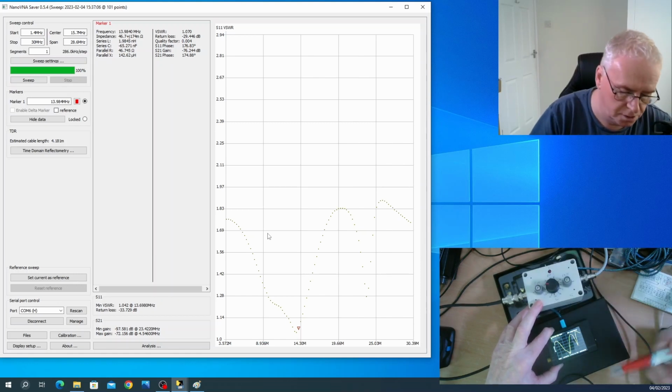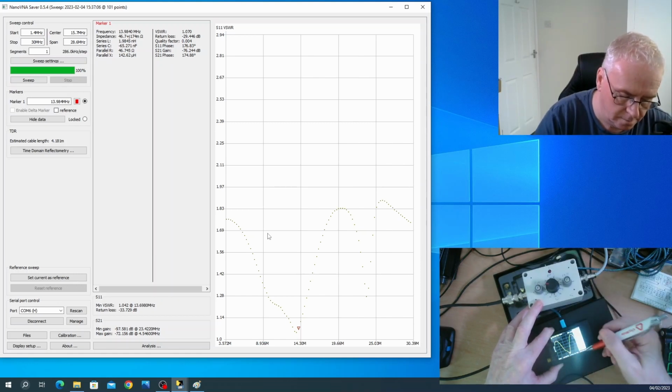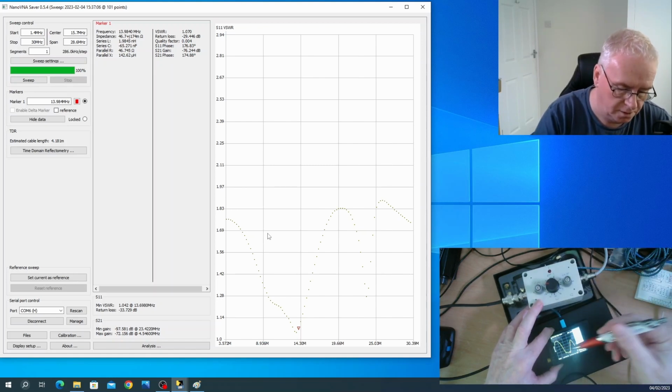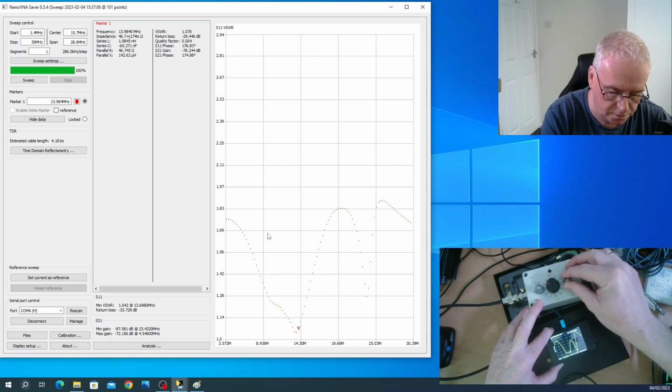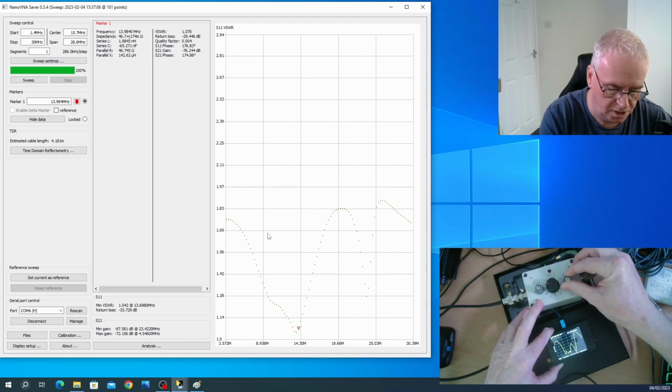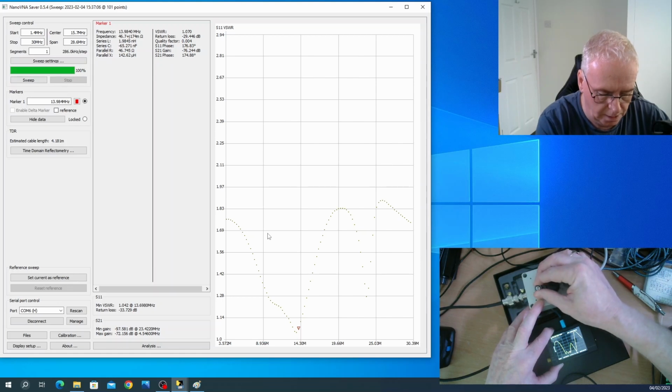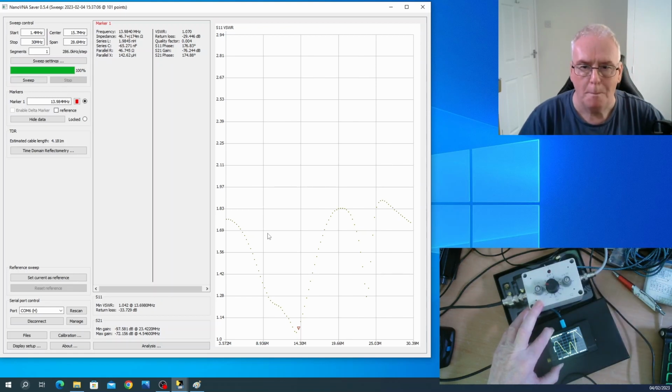Oh, it seems to have frozen again. I love it when things don't make a difference because the screen's paused. So that's the output capacitor. And as you can see, it's not having any real effect on that frequency. But what it is doing is it's changing the harmonic relationship. So now we're down to 1.06 there. So that's wonderful. Now, that's my calibration on 40 meters.